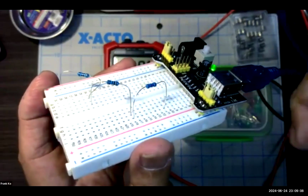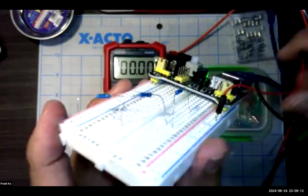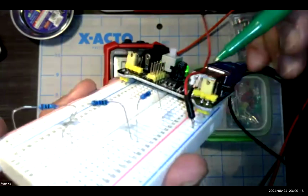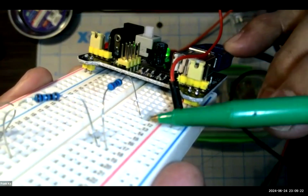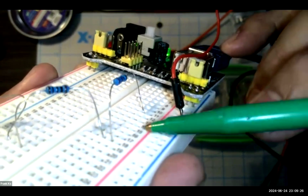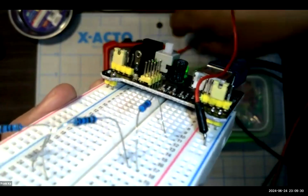All I have to do is have a pin in here. I'm going to put a pin in here. And so now I have a gap. The gap is physically right here between this wire of R3 and this wire of the blue rail. There is my gap. This is the only place where I can hook up my probes.